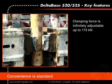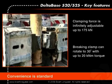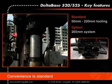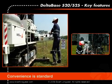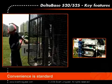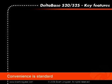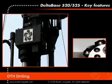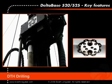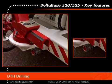Hydraulic make and brake clamps are standard supplied with the drill rig and eliminate the use of wrenches or other tools to brake rods and casing. The clamps can work with 50 to 220 millimeter tooling using two different sizes of clamp inserts. The driller's control panel is stored during transport and can be swiveled outward into drilling position to provide a clear view of the drilling operation. Hydraulic hoses are located inside the boom and control panel to protect them from damage. Both the DD52 and the HY79 rotary heads are suited for DTH operation without the additional use of shock absorbers in the drill string. The air connection for the compressor is conveniently located at the rear of the drill rig, away from the operator, to increase safety.